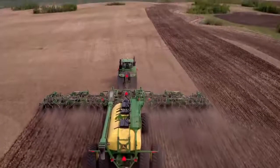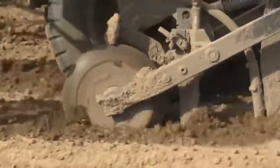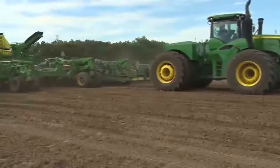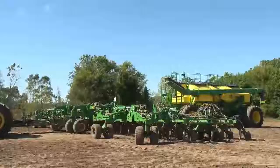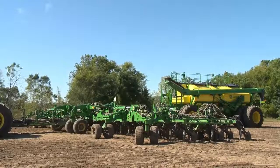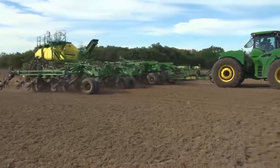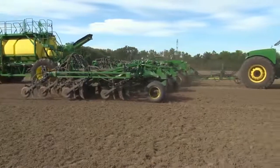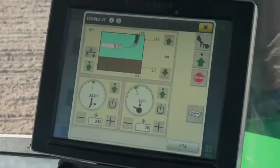This can be a real time saver and makes it easier to adapt to changing field conditions. In order to achieve proper seed depth, a full frame calibration is required. It's also wise to run a full frame calibration at the beginning of every season. Prior to running a frame calibration, begin with the tool on a level solid surface, make sure the tool is raised with the openers one inch above the ground, and pull the tool forward while raising the machine. This process will ensure that no binding between the frame and the wheel module joints exists.